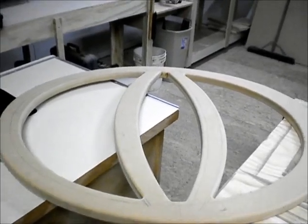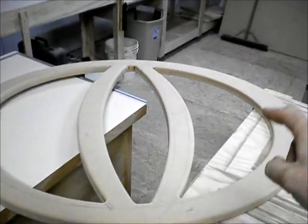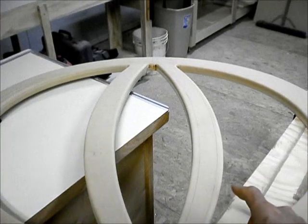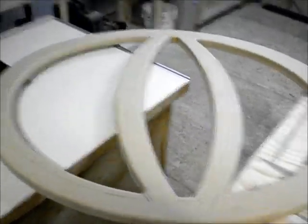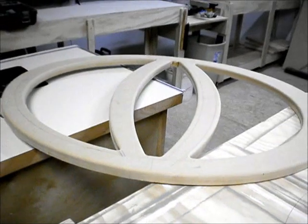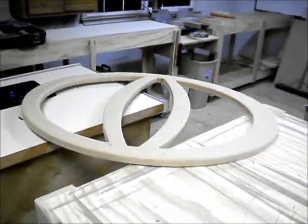To get these other lines I just mounted the plate here to get these two lines, then moved it over to here to get those two lines. It's wider in the center than on the ends, and you have to change the setup each time. To get the outside one, it was a longer major radius and a smaller minor radius — you have to change it around to get different shapes. I cut that out with a 3/8-inch cutter bit on the router, on one-inch lightweight MDF, about four passes per line, plunging in maybe a quarter inch each time.